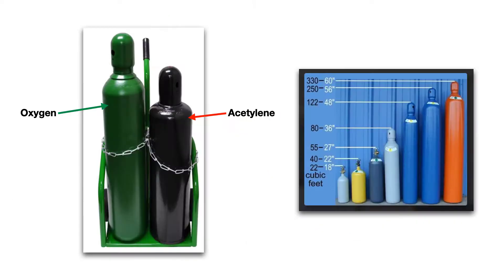You also want to wear proper PPE. This is what a traditional oxy-acetylene cart looks like. You always want to keep the bottles stored upright, transported upright, and secured with chains or a bracket. This chart on the right shows the different size bottles that are available. If you're doing just a small project once in a while, you could get away with a small bottle. If you're a larger shop doing a lot of cutting, you'll want to go with one of the larger size bottles.